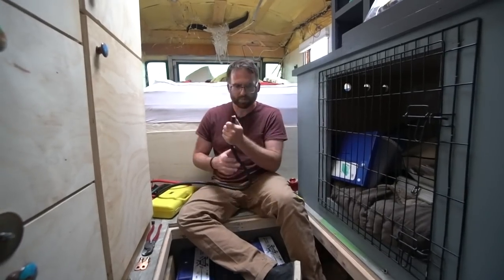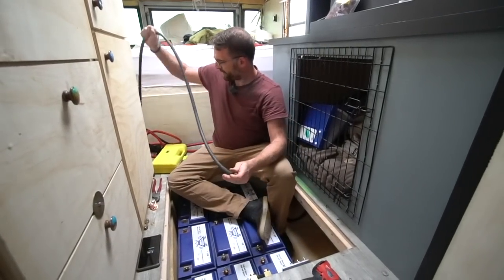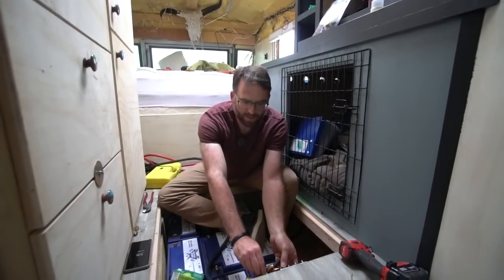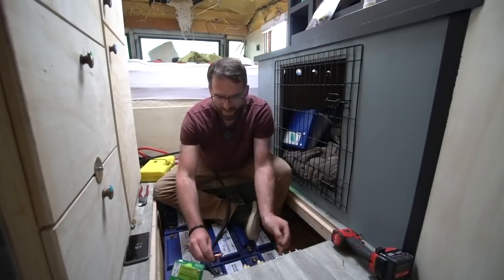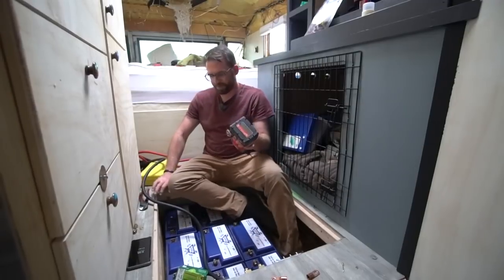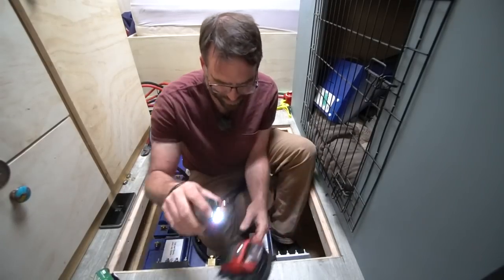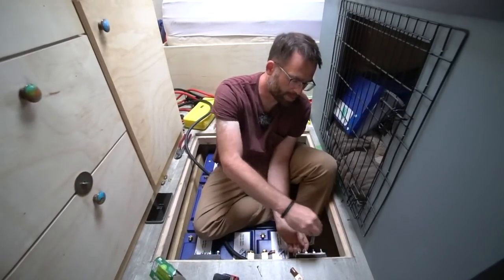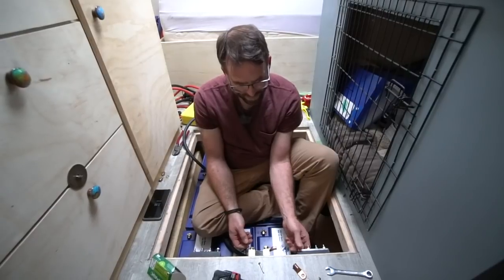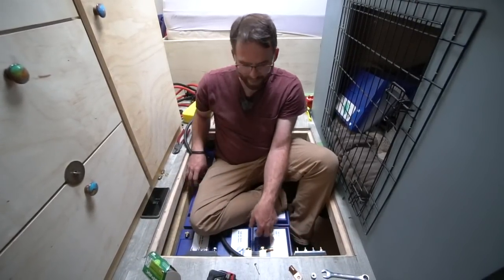So we're making some small jumper cables and doing ground work right now. Looking at these terminal blocks, I'm taking my big chunk of cable and measuring the distance, making sure I have enough length. I totally mounted that way too close, so I'm going to unscrew these and loop over just a little more. At lower voltage it matters more too. We've got a couple of bus bars here — I'm loosening up all the nuts on them because they're installed tight, and I'm trying to figure out the spacing for this wiring plan.